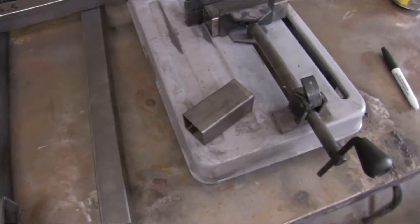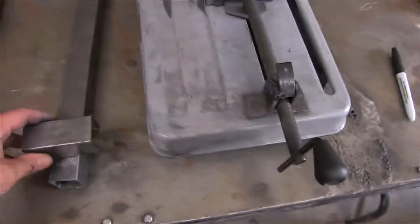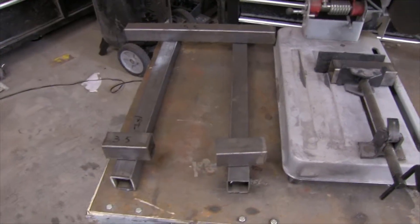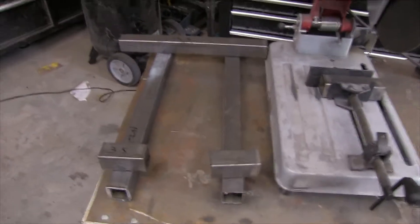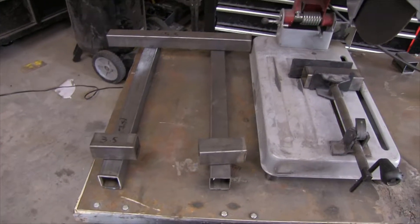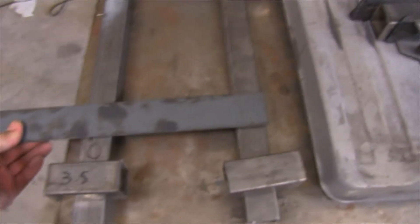On the back I'm going to figure out where to position these pieces — they'll go like so — and then I'll have a piece of flat angle iron to go across here to brace it. There are going to be two tabs coming up on each side with a hole for the bar that goes underneath to secure the bike using the two eyelets. I'll tack weld it together, check dimensions, and cut a piece of flat metal as a brace to keep everything at the right distance.